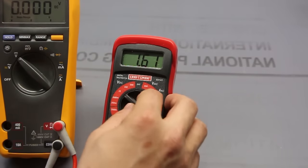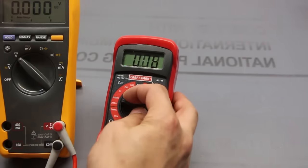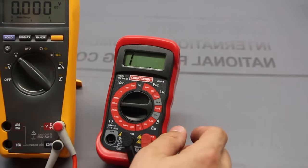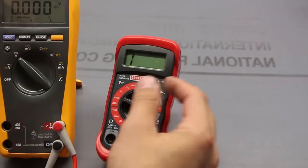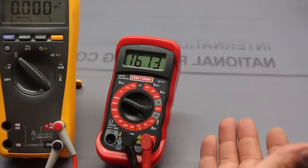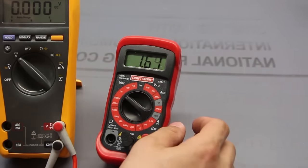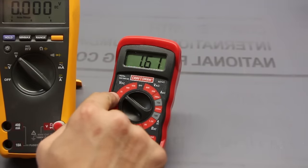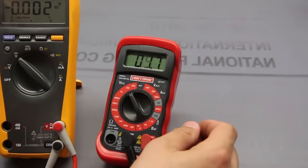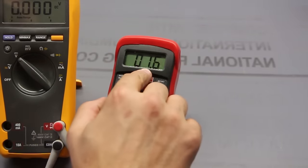So you're not gonna damage the multimeter if you go way over, or you go way under. It's not gonna damage it, but your readings aren't gonna look correct. And most of the time you can just feel, like clearly my battery's not 1,613 volts. So you can see the decimal point at the 200, you can see the decimal point at the 20. The difference between these two is you get better resolution. If I wanna measure up to 200 volts, you see that decimal point moves back.